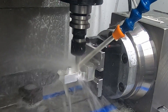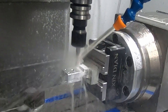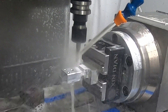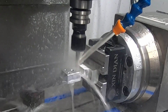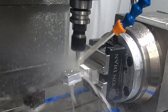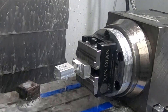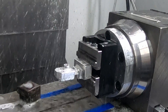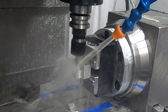The way that I set up the parting off is first I milled quite a bit of the material off of one side, and then I milled more of the material off the other side. You can see right about here it's starting to lean because it is thin enough. I should have finished parting off here, but then what I had it do is rotate, and you can see here it's going to gouge a little bit of that edge and then cut it off.